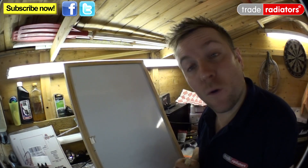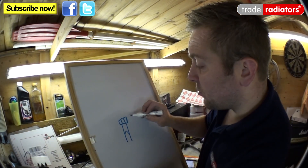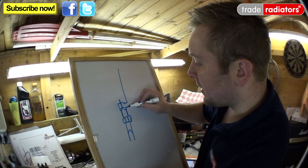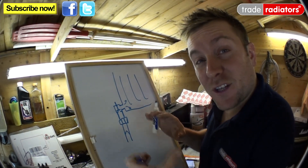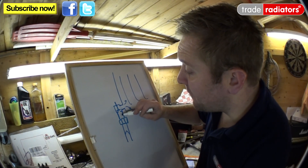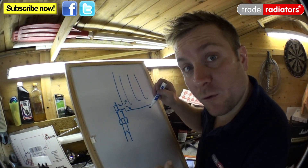How they do that is really simple. You have your heating flow coming up from the boiler in either a copper pipe or a plastic pipe or whatever the plumber's installed. Here's your nut. You'll have a valve seat like this, then a pin that can move up and down within the valve, which in turn can allow water into your radiator. We have the pin here with either a rubber or a copper taper on it, and at the valve seat there we have flow coming up from the boiler. If the pin is pushed down, there'll be no water coming into the rad, or if it's lifted up slightly, there will be water going into the radiator.